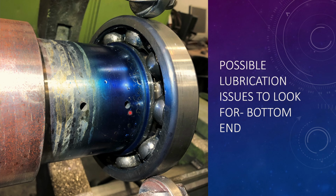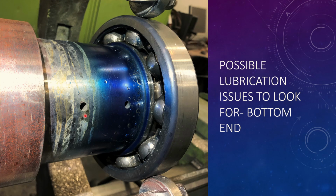It's very easy for the oil to whip around inside of that and start climbing and try to go over the oil tube and out onto the ground. So what they're doing is they're putting that vent right there so that as the oil climbs, it hits those two holes and it spins it out back into the bearing chamber. Okay. The second hole is up higher, closer to the shoulder.